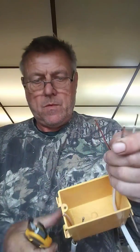Of course, you may have an outlet or you may have a switch. But just to get the idea of how the strippers work — I'm going to strip both ends like they're coming out of the box. Take all the insulation out. 4 to 6 inches is usually what I do. So here's your box right here. You've got your two leads coming in — one obviously hot, one obviously not. About a half inch, five eighths — you're going to find your 14 hole and strip off the ends about a half inch back on either side.